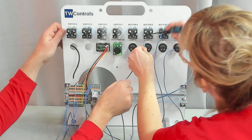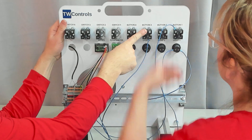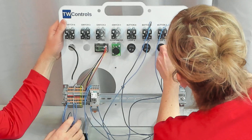Let's put it in the bottom of button three — normally closed contact. Now let's take a wire from the other side of that normally closed contact on button three back to where we just took that wire off of button one.